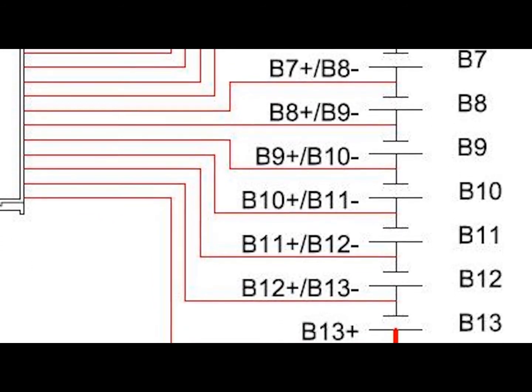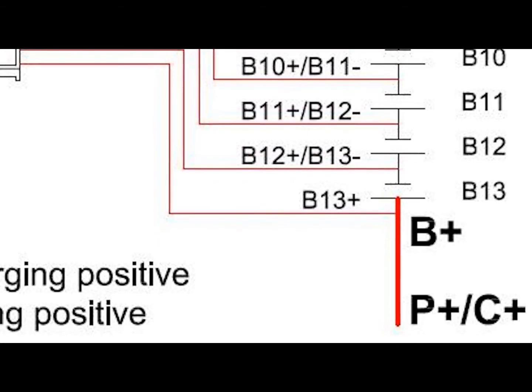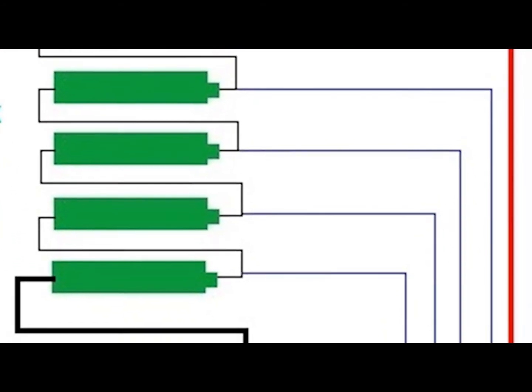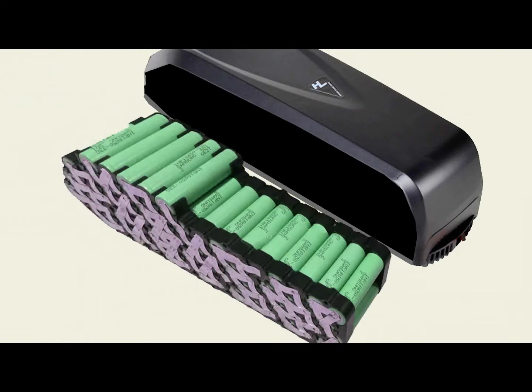The BMS is controlling items such as voltage — total voltage or voltage of individual cells — temperature — average temperature or temperatures of individual cells — state of charge or depth of discharge to indicate the charge level of the battery, its state of health as a measurement of the overall condition of the battery, and the current in or current out of the battery.